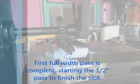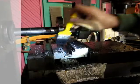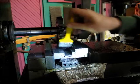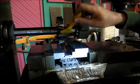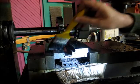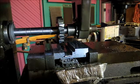Taking one cut. This is a 1 inch wide, 1/2 inch deep cut. Now we're going to back the cutter up a half inch, and we're going to finish this cut. And one more pass.